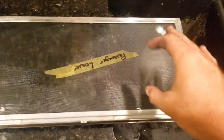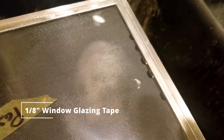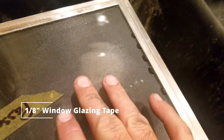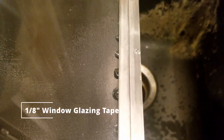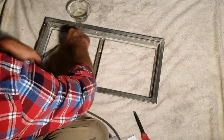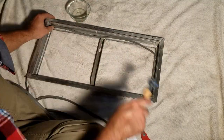Here I'm testing the glazing seal. Between the window and the aluminum frame there's a piece of tape called glazing tape — that's the first seal of the window. This is the original glazing tape, and you can see little droplets falling on the underside, so it needs to be replaced. I ended up replacing all the tape. You can easily remove the glass by heating up the window a little bit — the glazing tape will lose some of its adhesion.